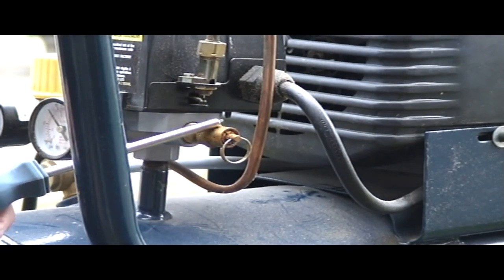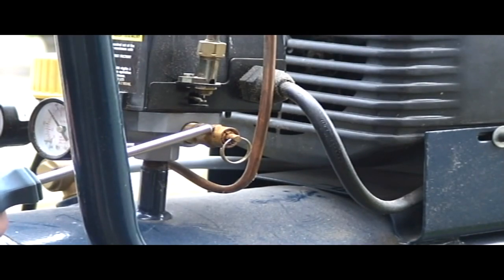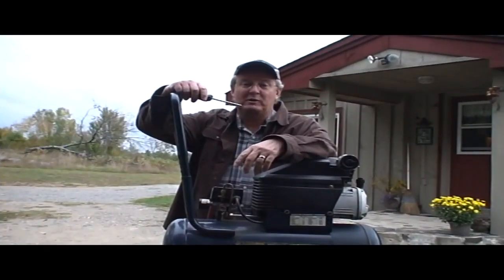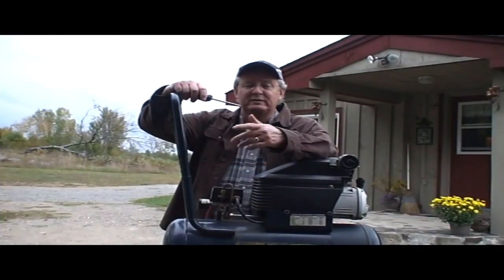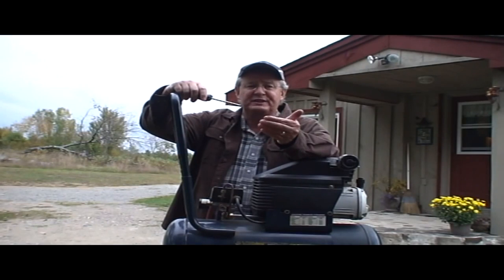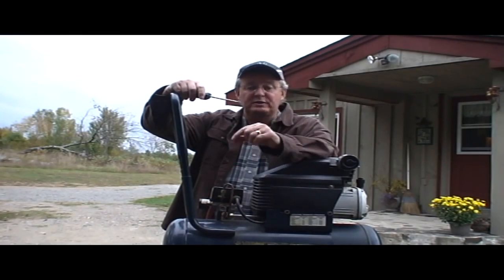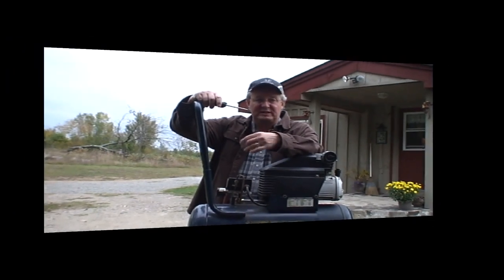This is just a mechanical device with a small piston inside that will override the stiction of the PRV when the pressure gets too high. What's stiction? Stiction is a term a dear friend of mine, Jim Graham, came up with years ago. It's a combination of sticking and friction, and keeps parts from moving when they're not supposed to. In terms of the PRV, it's just the friction between the internal parts that has to be overcome when the PRV is going to set off.